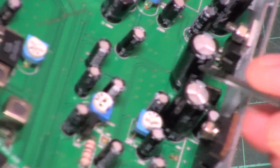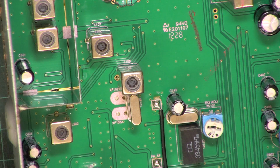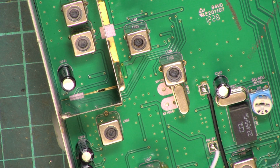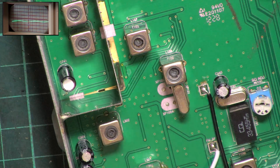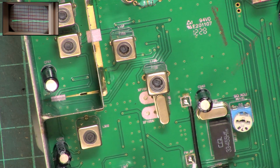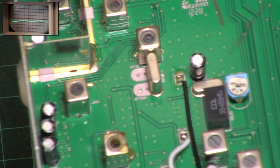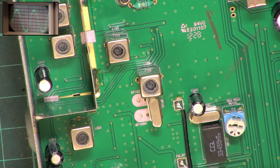So there we go. So that's been changed, and now, hey, how wonderful's that? So we'll put the picture-in-picture on, and let's have a look at the oscilloscope. So recovered audio. I could tell this set's very sensitive even when it was not working. So we'll put an S9 equivalent signal on, which is there.